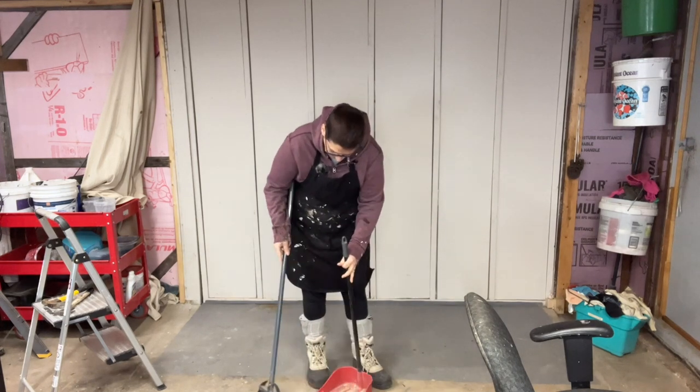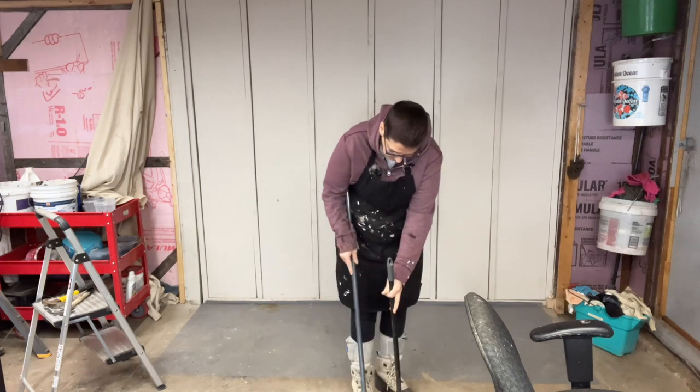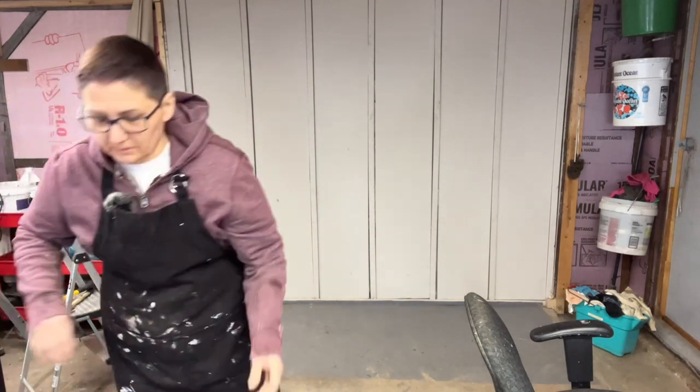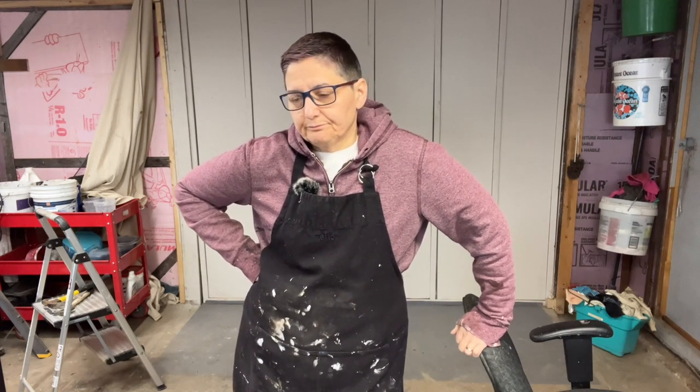I just had a big dining room table come in and I was thinking about recording it for you guys. But when it came in, the homeowner's friend had already attempted to sand the top — they only sanded it a little bit and then tried to stain it, but the top varnish was still on there. It was all blotchy, absolutely horrible. I sanded it all down and then decided to use gel stain, because gel stain covers sins. Gel stain is fabulous if you're painting on metal, fiberglass doors, or anything where you want a wood grain look.